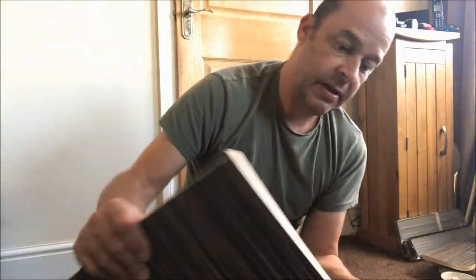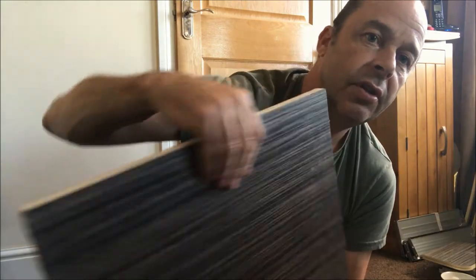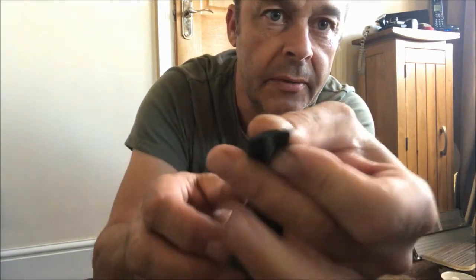So you want the lip on the outside — there's a lip on every piece. For the drawers and things I've been starting from the bottom, going all the way round, ending at the bottom. For the cupboard doors I've been starting on the hinge side in the middle and finishing there. You could start on the bottom as well on the doors, but I've been doing the hinge side. So the lip — I don't know if you can see that — it's like the profile, it's got a little lip on this side. Once you see it, it's easy.